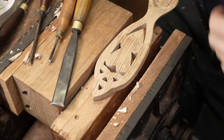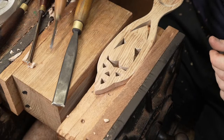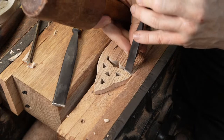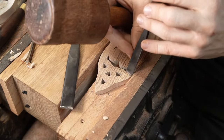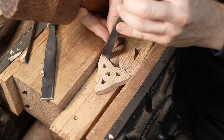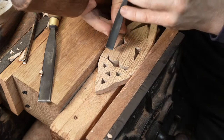Now the process with this one, something we carve regularly, and what we're trying to create, the V gouge is useful. Not one that we use a huge amount, but that's individual. That comes to our style of carving, what we do, how we do it. So, to demonstrate this one, you start off with your stop cut. So you've got the stop cut down into the wood, over to the other side, and we do another stop cut on the other side, just like so. So that gives us the overall shape.